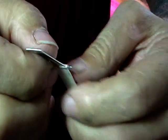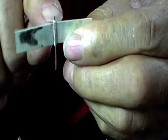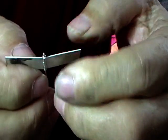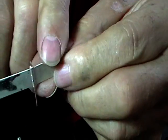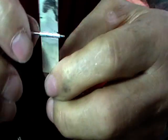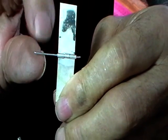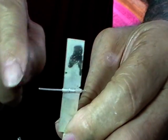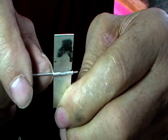I've put my hinge wire through and checked it for fit — it's a nice fit. So now I'll take it out and file these ends flush with the metal. What we do is: first we take the total length of our metal, we add the thickness of our wire, and that will be the length of our rivet. So this is just a long rivet, or half the thickness of the metal sticking out either side.